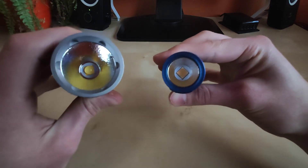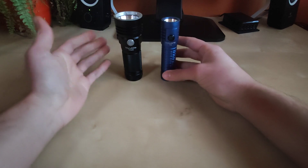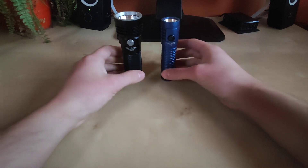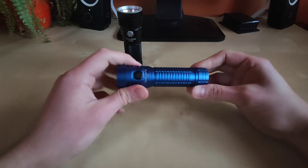The GTFC40 comes in at 4000K and 95 CRI, comparing to the 70-80 CRI of the XHP70.2. But you may ask: what about efficiency, stabilization, and overall output?